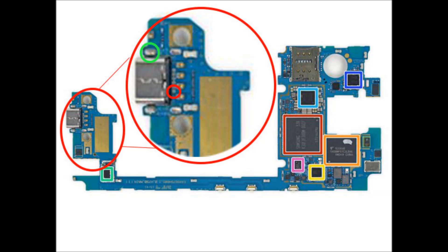You'll also want to pre-tin your wires to make soldering easier. Then, simply solder your wires to a wireless charging receiving pad. Make sure to use a voltmeter to verify the positive and negative connections on the pad. You'll also need to peel back the sticker covering the pad to access the main positive and negative contact points.